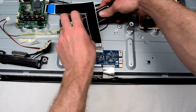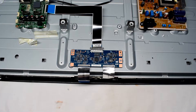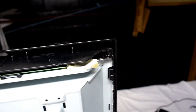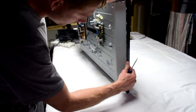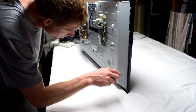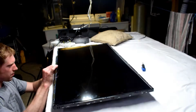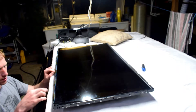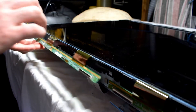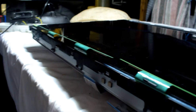So I need to take off the front panel. To do that, first remove the speakers from the main board and then also disconnect the ribbon cables. We need to remove the plastic bezel that holds the screen on. Just using a screwdriver, you can pry that bezel off going around the outside and then pulling it off gently. Now what we're going to do is fold the ribbon cables of the LCD on top of the screen.